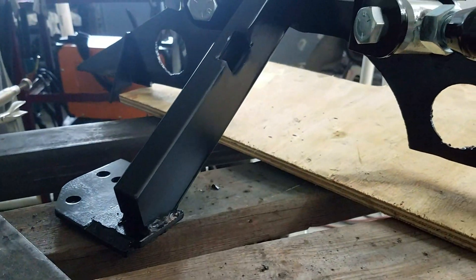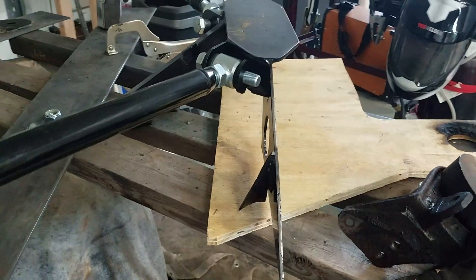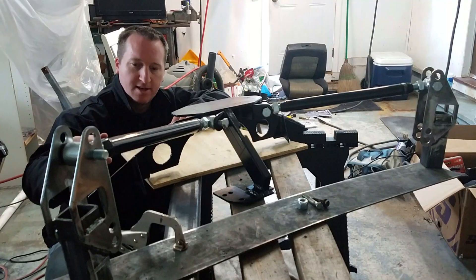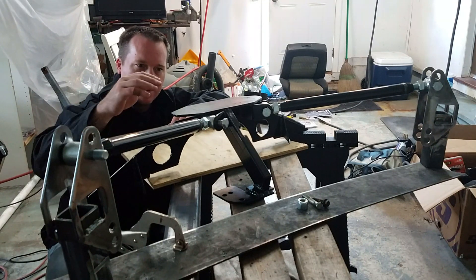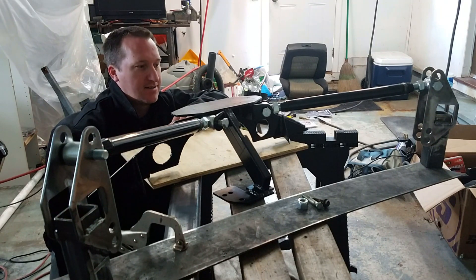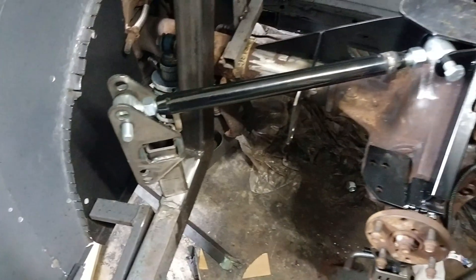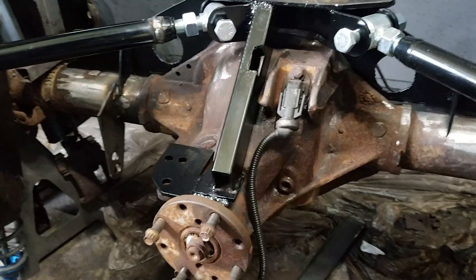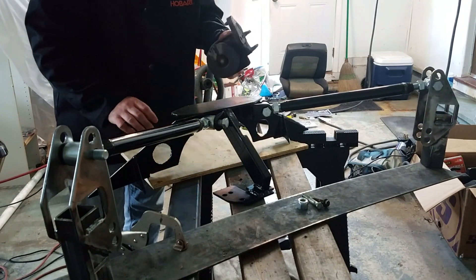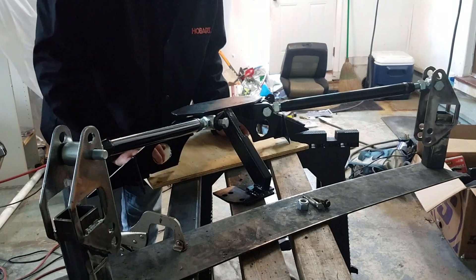Same thing with paint — I put a coat of VHT chassis black paint on here, did a couple of coats, but I haven't connected this to the axle yet. What worked out really well is I still wasn't quite happy with a little bit of flex I noticed in the bat wings. I have a feeling this is going to be taking a lot of pressure as the car drives down the road, so I wanted extra confidence it would stay on the vehicle. I welded in a tube down the front here that connects with three bolt holes — it's actually stock as part of the 8.8 rear end. The pumpkin has what looks like a panhard bar bracket, so I took the bolts out of that, which left the holes behind, and I built myself a little plate to connect it to.